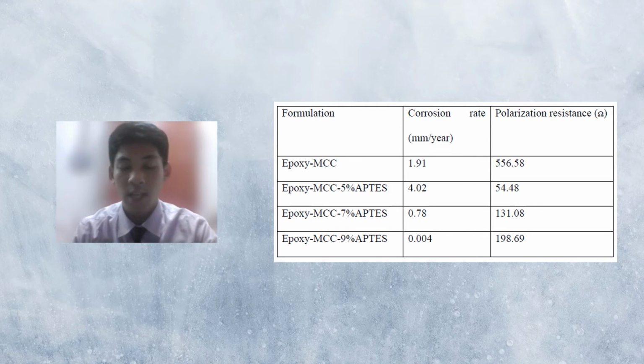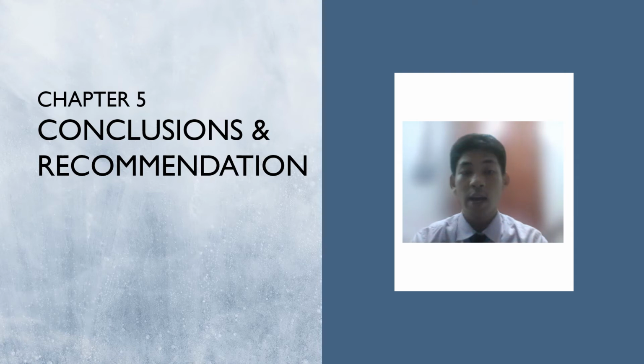For epoxy MCC at 0 sonication time, the corrosion rate is 1.91 mm per year and the polarization resistance is 556.58 ohm. At up to 9% of silane-treated MCC, it gives the lowest corrosion rate, which is 0.004 mm per year, and the highest polarization resistance is 198.69 kilo ohm. And last but not least, conclusion and recommendation.